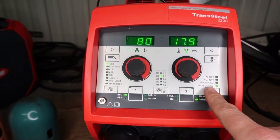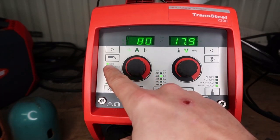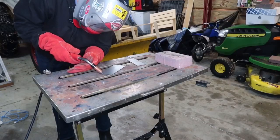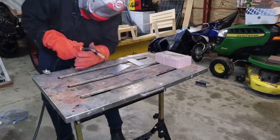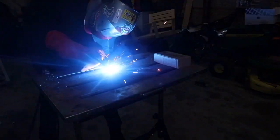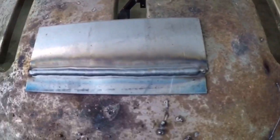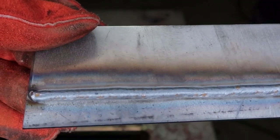There's not a direct option for 95-5 oxygen, so I'm using a substitute with 0.030 wire diameter set up for steel for 80 thousandths plate thickness — 280 inches per minute and 17.9 volts. It's an 80 thousandths mild steel lap joint. Very clean, minimal spatter — nothing at all.